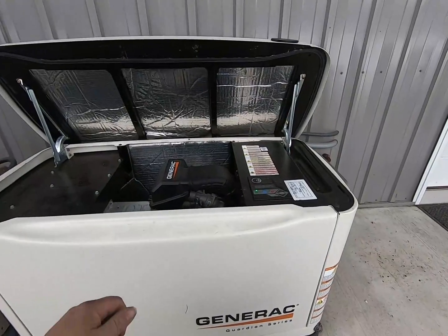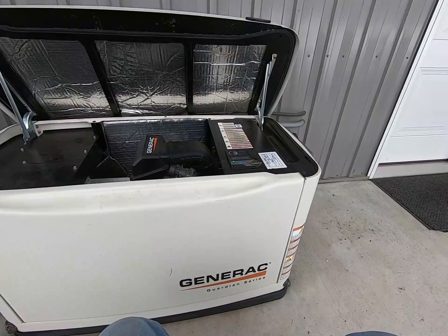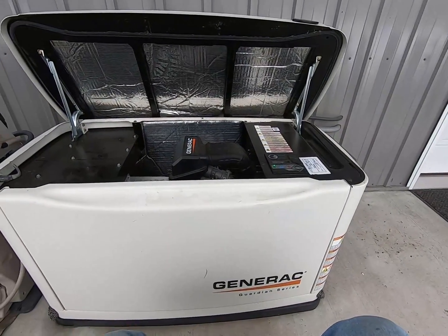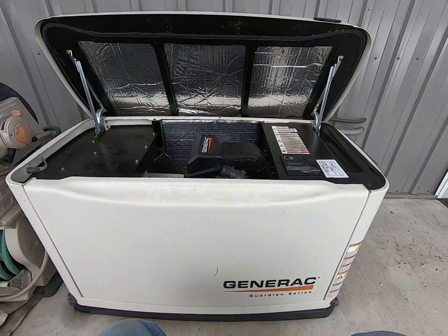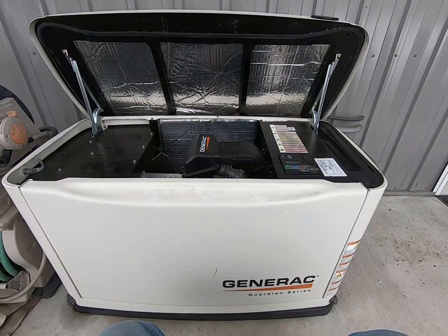Cold is hard on a battery — it draws them down. So about seven years out of the lifespan of the battery, I'm pretty satisfied with that because it's really not even a very big battery, just a standard lead acid. I was thinking about putting an AGM in here but I'm not going to do it this time — maybe next time. It takes a 26R battery and I already went and got one.